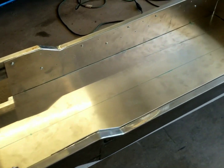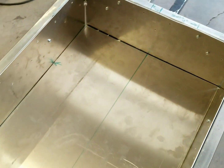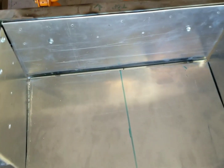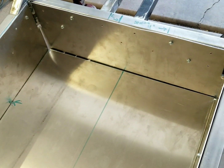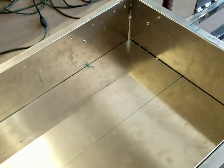Massive progress — the floor is cut and fit. I took careful measurements but still had to trim off quite a bit off both sides; it was a little wider than expected. It fits pretty well now. The front will pull in together to close the gaps, and I've marked and clearanced the right spots. I pulled it out, marked where the other panels go, and now I'll drill out the rivet holes and get it bolted in.